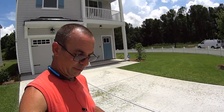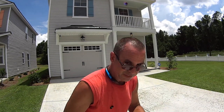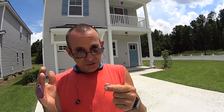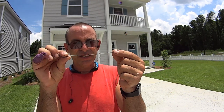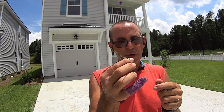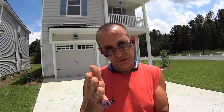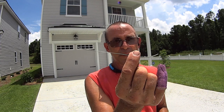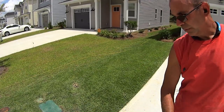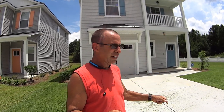But let me show you what I've been dealing with here. See how this stuff is like a straw? A lot of people say, hey, why are you cutting in circles? I'm not really cutting in circles, but even with the side chute and the mulch plate on, if you go back and forth, you're still gonna be leaving straws. By continuing to bring it into the center, it keeps cutting it smaller and smaller. Until the last few passes, you saw I put the chute down, mulched it up, then opened the chute and blew it away to a fine powder. Had I not done that, this would be sitting on top of the grass, because this is what came out right here. I wanted to make sure we mulched it up to a fine powder so it doesn't get all over his little dogs.